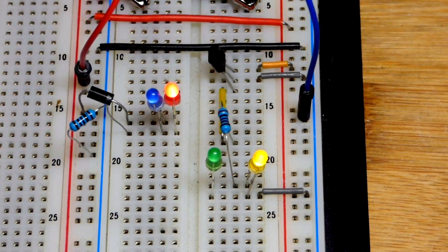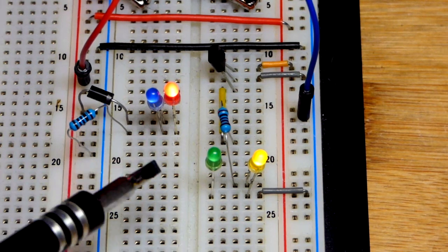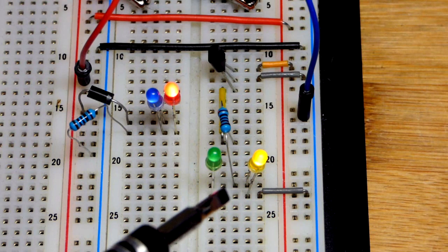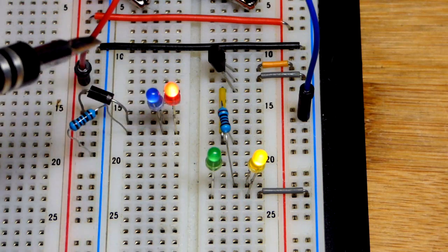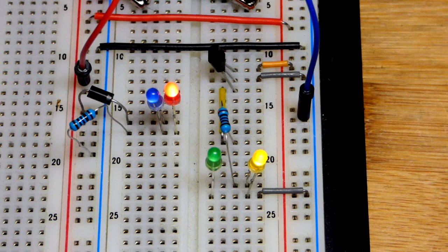So now in this video, we're gonna look at reverse polarity protection. I wired up a couple of circuits here. These are polarity indicator circuits. Right now this side of the circuit's more positive, so the yellow LED is lit up, and that circuit, again, more positive there, so the red LED is lit up.